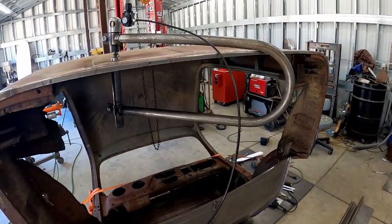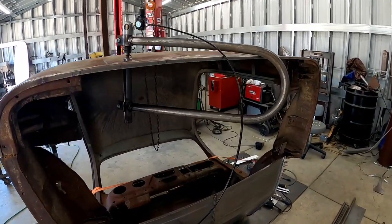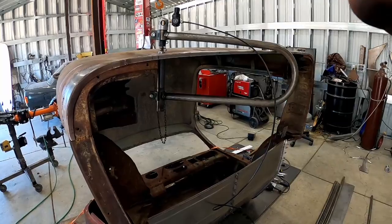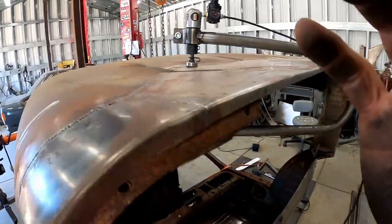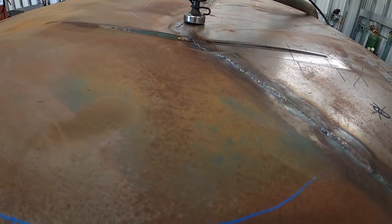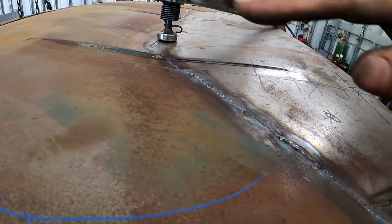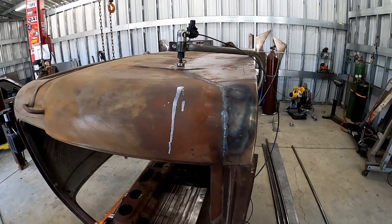Just getting started but I figured I'd show you how much better the fit is — it's a lot easier to use now. I'll set the camera up for a wide angle shot. Just going across the seam back and forth until it's smoothed out until we start to get a crown instead of it being sunk in. What we're trying to do here is stretch the weld seam.